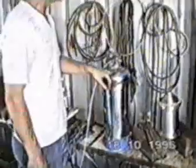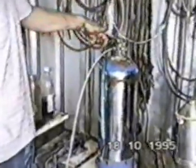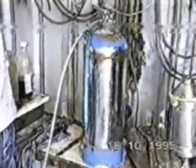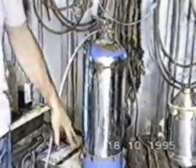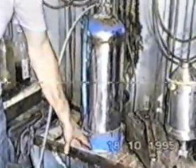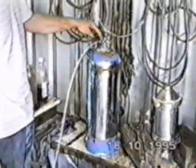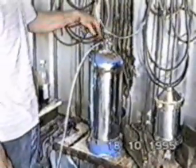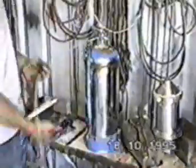On the other one, stainless fire extinguisher. Negative in the top. Neutral plating on the inside. Okay, tubes. Negative travels down the centre right to the bottom. I'll explain about that soon. Positive hooks up either here, here, or if you want the best gas, hook it up to the furthest point, around here. Or out there. You can release that and bring gas out the front. You leave it off, gas comes out here.